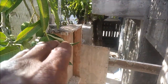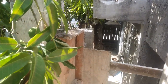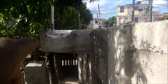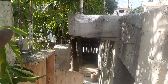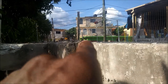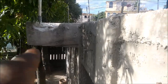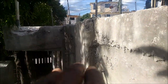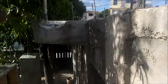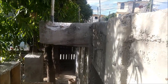and take out the boards, which is tomorrow, Thursday, about tomorrow evening to Friday morning, we'll take them off and then start forming up the little slab I'm going to put over there, and then we'll send in a beam over here. So what I'm going to do now, this steel up here, I'm going to bring it down into the beam or into the slab, so at least we can have some tying points from here to there. And back and forth. Anyway, it's not going to require much because everything is already solid.